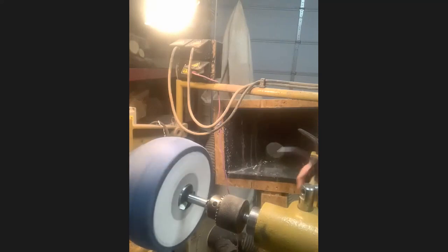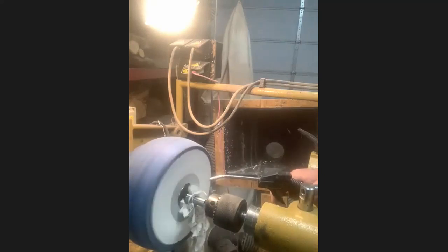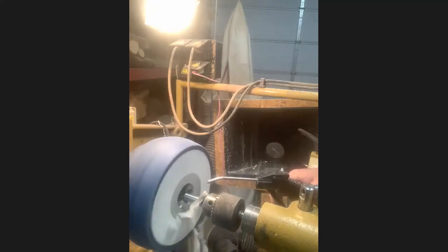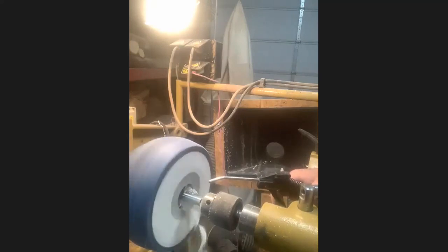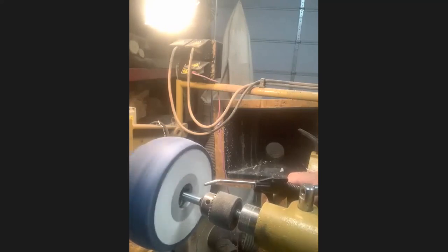As Trey said, blowing air on the bit helps. That's an old pen drilling kit. When you're drilling pens in your drill press, you cannot imagine the amount of force that quill gives you pulling down. If you could eject a nice cool spray with a nozzle like that, even in a pen, you'll save from burning material up and tearing it up. And as Trey was saying, it helps for an overall effect.